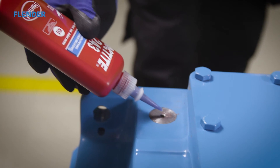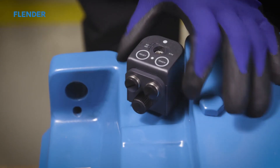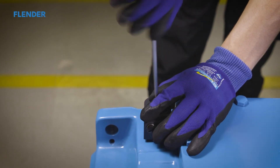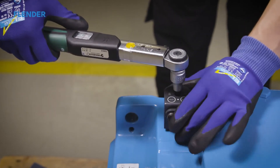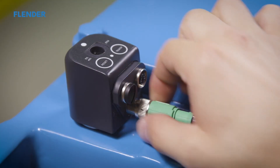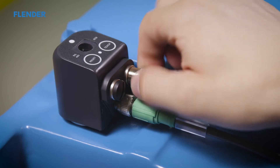In the next step, the adhesive is inserted in the bore to serve the fixing of the screw. The DX500 can now be screwed on using the Allen wrench and fixed using the torque wrench with the prescribed torque. The power cord and the Ethernet cable can now be attached and secured with cable ties.